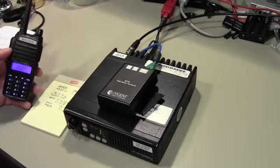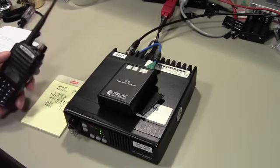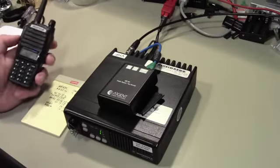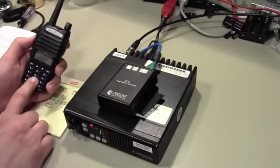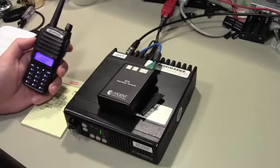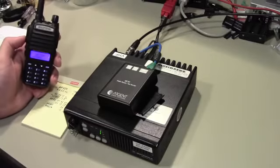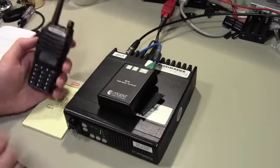Alright, so it played it back in Morse code and then did the triple beep to confirm it. If you aren't quite as good at Morse code, which I am not, and need to hear it again, #86 will play it again for you. Alright, so yeah, I got that right. It says W6KWF/SR. Right, and then to turn on the CWID, it's #801.